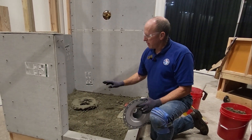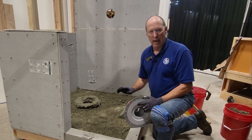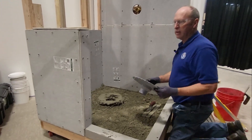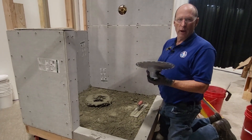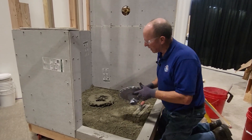So we're going to do that. This manufacturer asked me to put a ring of a little bit of damper mud around the drain and then we're going to set this bonding flange. Normally this is on a mock-up — this is not a practice that we're using. Normally we would have a drain that we would attach this to, but this is just for our mock-up, our sample today.